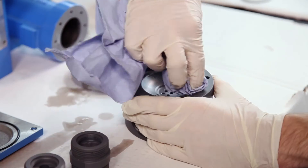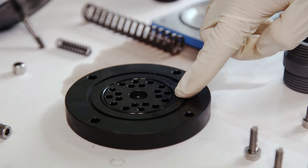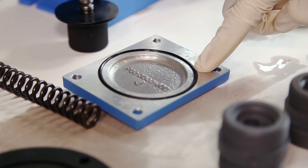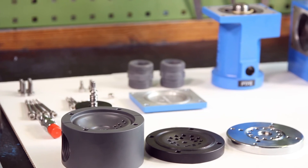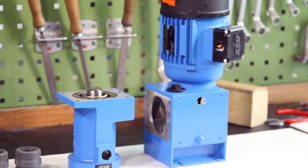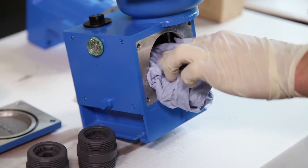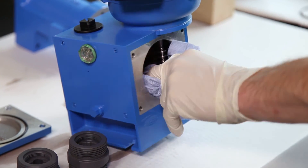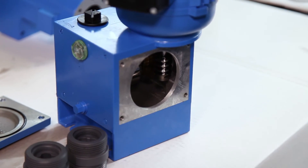Now, all the old parts should be cleaned and checked for damage. You can remove and dispose of all O-rings and the oil level glass. If cracks show in individual components, those should be replaced. Particular attention should be paid when checking the pump head. Likewise, the interior of the driving gear should be roughly wiped out. Any oil sludge or abrasion which has accumulated should be removed.